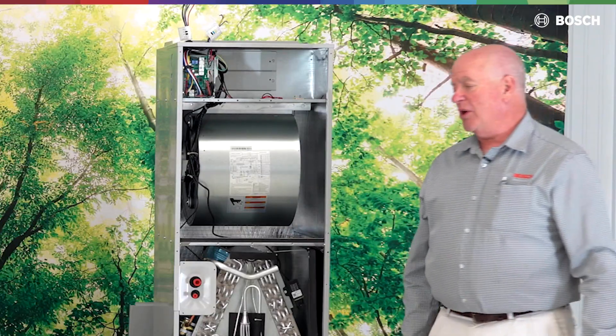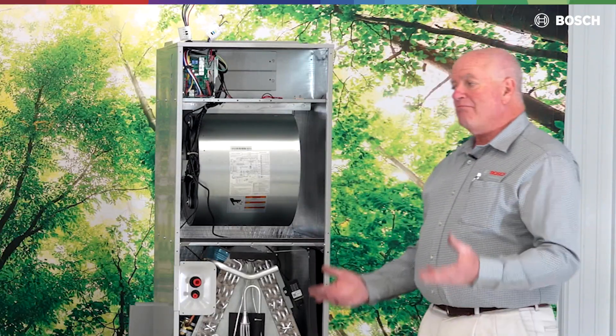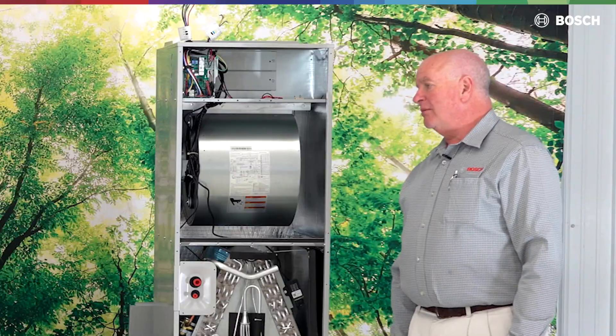Your vacuum pumps and reclaimers have 10-foot longer cords — they want a 10-foot isolation zone around that unit so no one comes in with an open match, a light, et cetera, where something could go wrong.